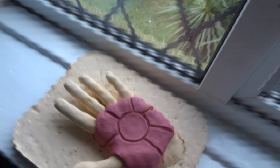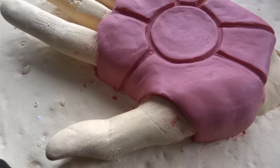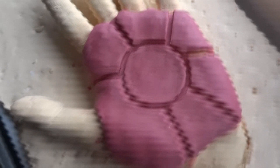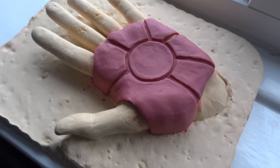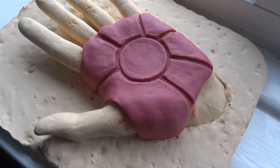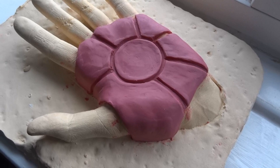This is what I've got so far. I've just put this on the window ledge so we've got daylight outside and you can see the imperfections a bit better, of which there are many. There's quite a lot of smoothing to do. Basically I've cut in the major features and the clay was a bit thin on that side hence it's gone through to the plaster, but it doesn't really matter. When I make a mould off this and a plaster cast I'll be able to sand that as well, and then vacuum forming over it will mean that lots of the minor imperfections won't show through. It's best to have the smoothest sculpt you can because clay is a lot easier to smooth — at least it's softer than a rigid cast.